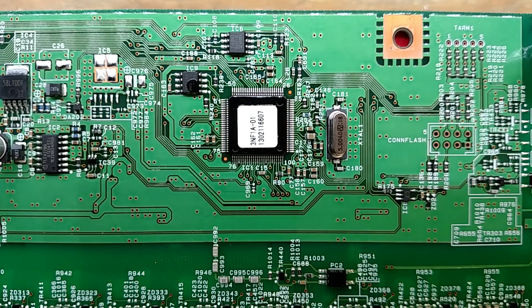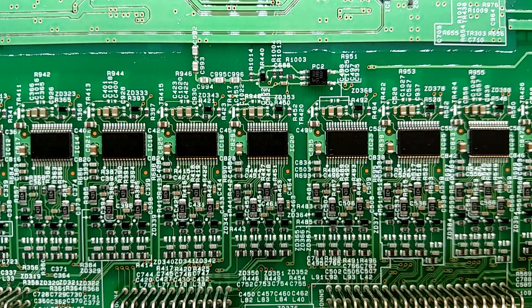Their microcontroller is specifically trying to balance 96 cells, and I'm not going to be using 96 cells, so that's going to cause problems. Since I'm on the CAN bus already I'll be able to read that and make good correlations. What I don't know is whether it will attempt to turn on the balancing resistors when I'm not charging the pack — I'm wondering if I need to send it a signal to say I'm charging, or if it's smart enough to notice on its own.